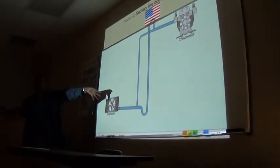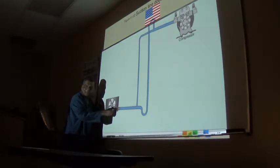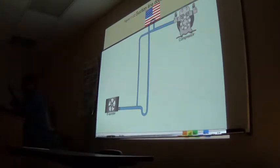Right? And one of the beauties with these, they have a pressure tap valve right inside here. Now you can actually read this pressure to make sure you have the right evaporator saturation temperature. So these are the little things with refrigeration that if you don't address at the beginning, it comes back to haunt you big time.